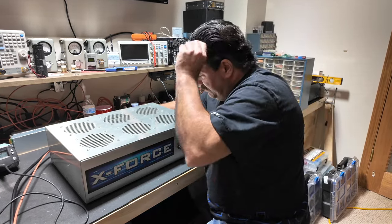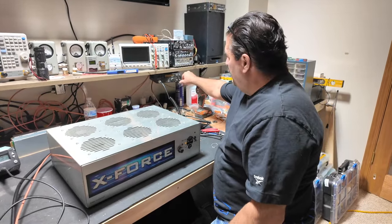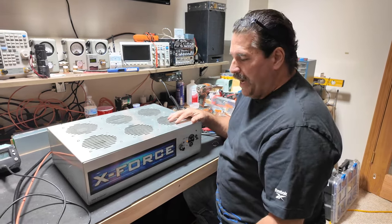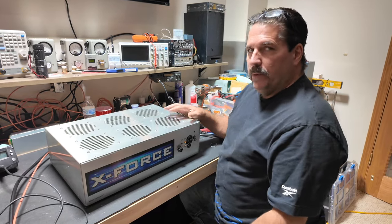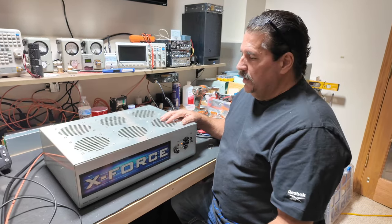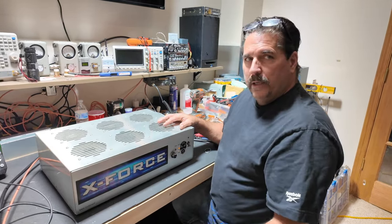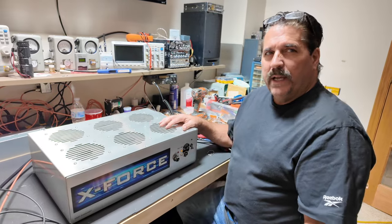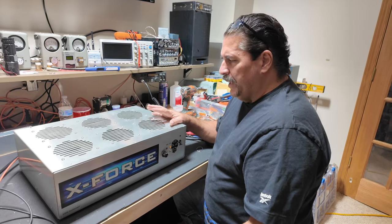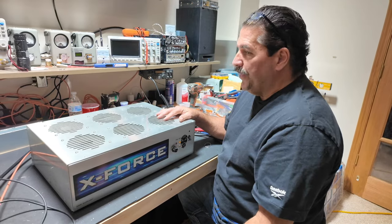Yeah, it's awesome. All day long. So what we're doing is we've got this HR2510 running into this straight 8 pill with bias in it. Just a radio swinging up to about 600 birds. You can put more drive into it, you know what I mean? But what does that radio do, about 20 watts or something? 20, about 25 watts sideband, I think. Okay. I can double check it, about 25 watts sideband. But this thing with about 50 watts into it, it'll probably do 800 to 1,000.